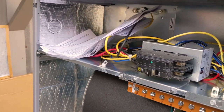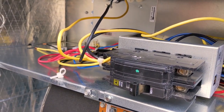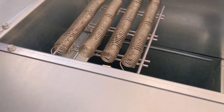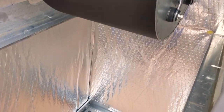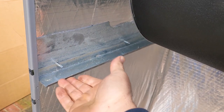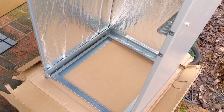On this air handler, the first thing that needed to be done was installing a 5-kilowatt accessory heat strip. I don't really plan on using it much, but I was informed it might be necessary in defrost mode. Since we didn't receive the downflow kit we paid for, we made our own — we turned the A-coil upside down and mounted it there, because the whole unit needs to flip around to work with this mobile home.